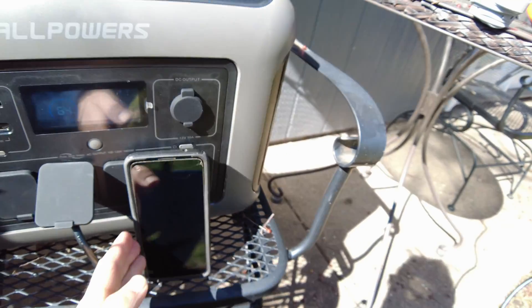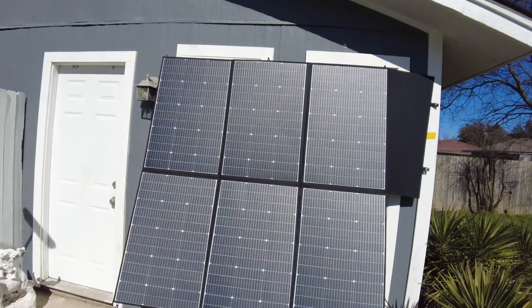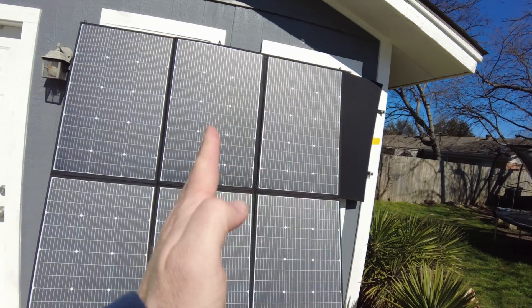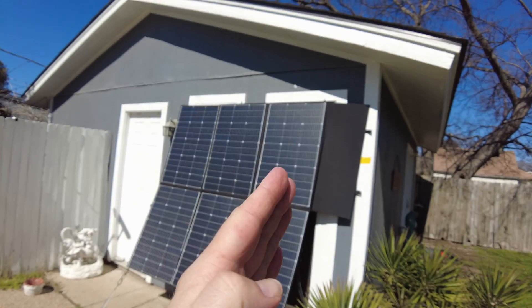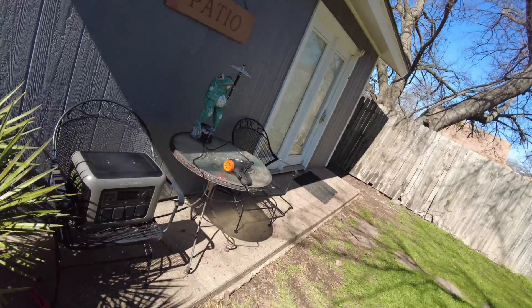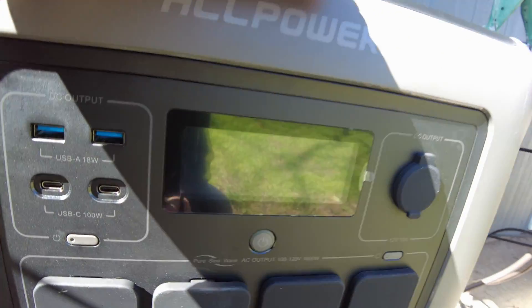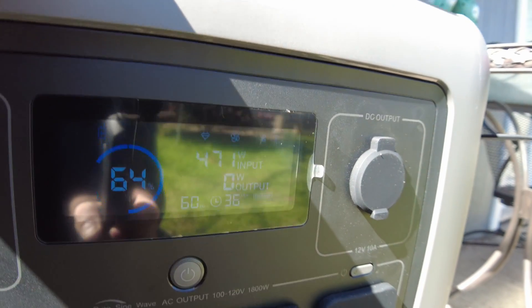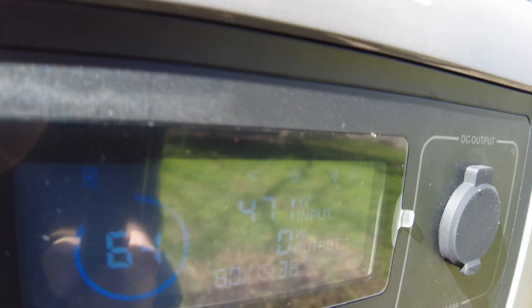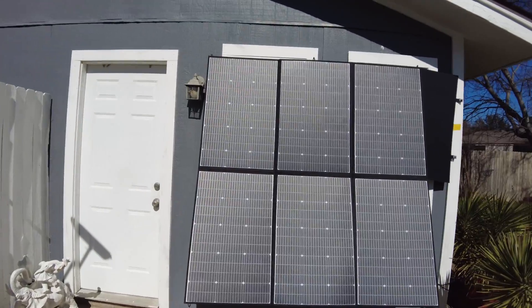479 watts now. The app is showing 480 watts. I wonder if I can get it any better — the sun is a little bit off to one side, not perfectly lined up. I'll wait a bit and let the sun get in position. The sun is pretty much square on now. We're actually at 446... I wonder if we just didn't get sun-soaked or something. When panels heat up they start to lose efficiency. Looks like we're kind of at 470.